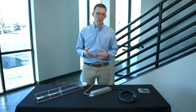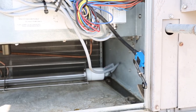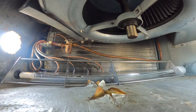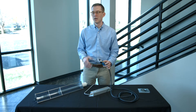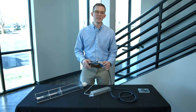We also mounted a door switch on the panel so that anytime a panel is removed, the UV light would automatically be switched off. This is a very important safety consideration so that anytime someone is maintaining the HVAC system and pulls a panel off, they won't be accidentally exposed to any harmful UVC energy.